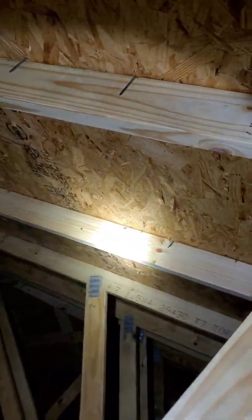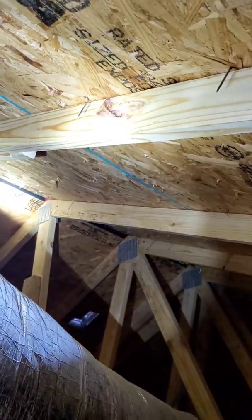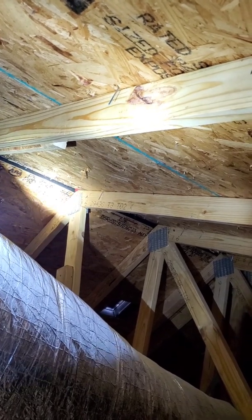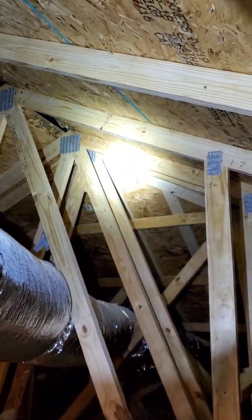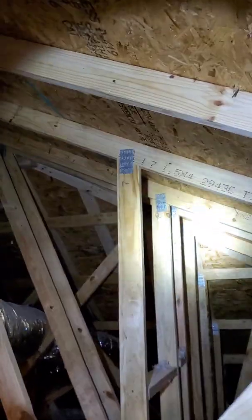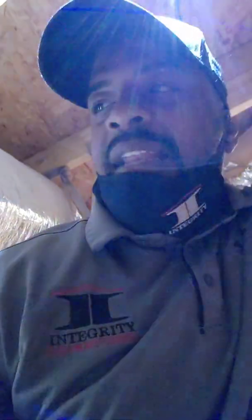That's basically somebody with a nail gun. They thought they hit the stud and they really didn't. So there you can see where the nail caught a little bit of the beam. It missed the beam on the second one, and so forth, all the way down. And right here you can see where he literally missed the whole beam. If you're a roofer and you notice that you didn't hit the stud, usually you'll go back and try to line it up again and hit the beam, but sometimes people just don't care for their work. But we're going to put that in the report.